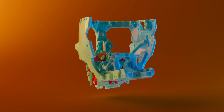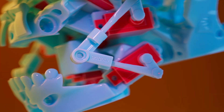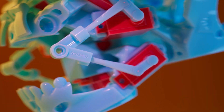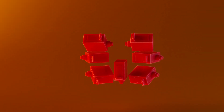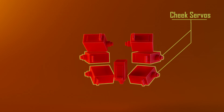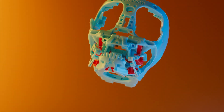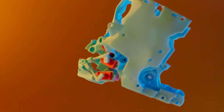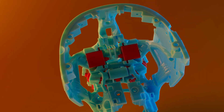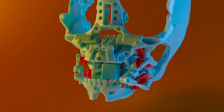Recently I've spent some time redesigning the mouth parts for Henna's head. I'm using seven motors now instead of three: one lower lip motor, two upper lip motors, and four cheek motors. The lower lip is the same as before, although I had to move the motor centrally to make room for the upper lip motors. And I had to completely redesign the jaw to make space for all the cheek motors.